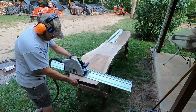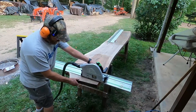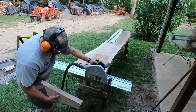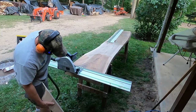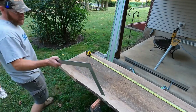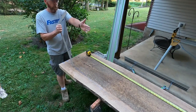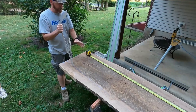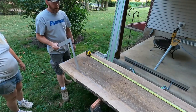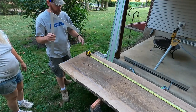I'm being careful of my fingers around the knots. There was a sound — turned out it wasn't metal, just the gnarly crotch grain. I've already made my line down here with a blue chalk line. Measuring the narrowest point — 16 inches is what they were looking at — and I tried to balance it out the rest of the way. It goes upwards of 19 inches in the middle to about 17 on each end. There's a narrow point where the slab curves in to 16 — that's the narrowest they wanted, so that's what we went with.